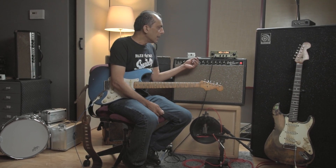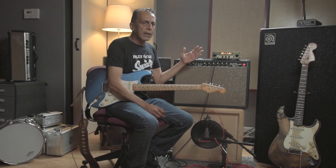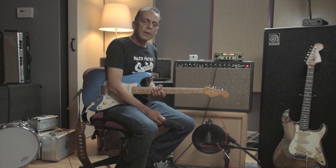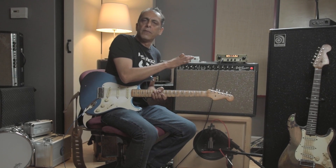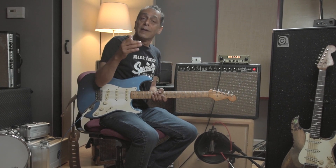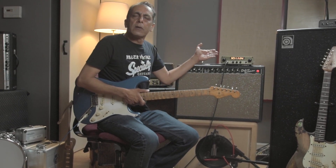So, as you can see, this test was a little subjective — we set the amp where it sounded to us like the best clean sound, a blend of clean and a little bit of dirt. You probably noticed that when I dimed everything, it didn't really get much louder, if any at all. The concept of headroom and clean headroom is really just the concept of how much dB you can get out of something distorted versus clean. You'll back down a little bit from that distorted level, but essentially your ultimate headroom is set by the power level. So this gives you an idea of how loud this little amp really is.